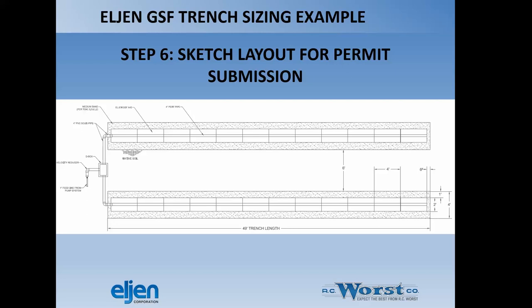So here's a picture of what this looks like. You can see the pressure line coming in. In this case, it's a 1-inch feed line from the pump system. We have a velocity reducer. In this case, it just necks up to 4 inch and hits an elbow to slow it down before it goes to the D box. The D box distributes the wastewater equally to each trench.